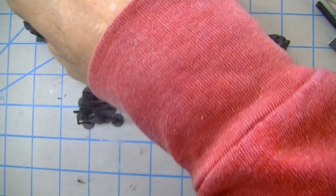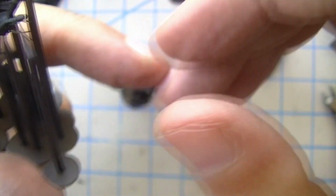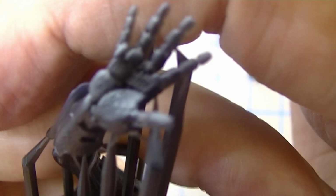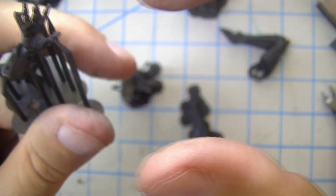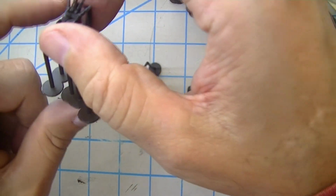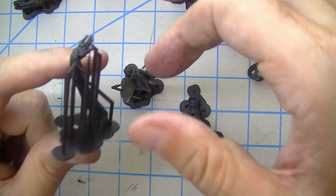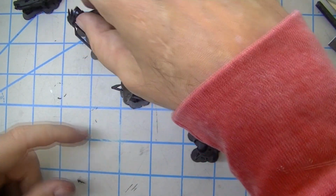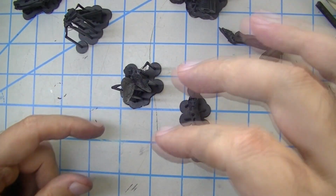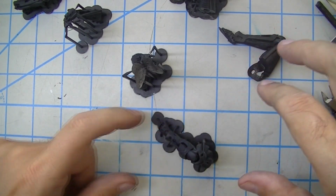Now, with this other batch, which was a reprint of the arm, I changed the orientation, and it came out perfect. You can see there's the thumb. It's all good. It's all happy. I also completely changed the supports. What I did here is I went in and did a search for islands. Those are parts of a layer that are not attached to anything else, and an unsupported island will definitely screw up your print.